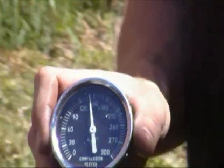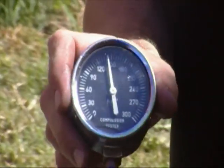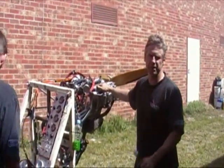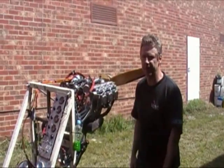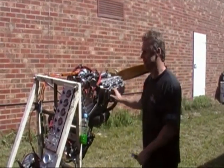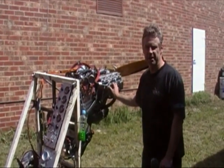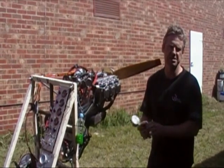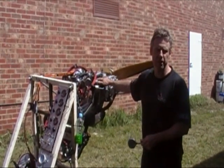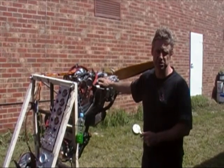This is an old engine with old pistons and original rings, just without the original heads. We can see that with these cylinder heads running at around 80 degrees Celsius, which is a fraction of the temperature of the Jabiru air-cooled head, these heads will never need re-torquing. The reason you have to re-torque the original heads is because they are yielding. These heads are more structural, they cool better, they will not yield, and they will not need to be re-torqued.